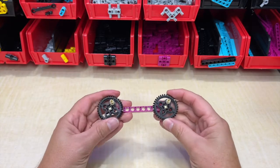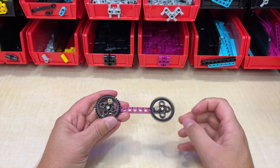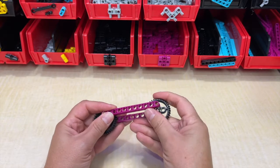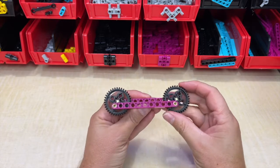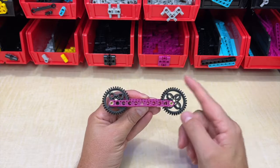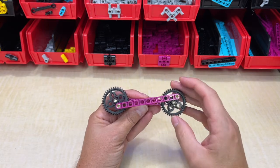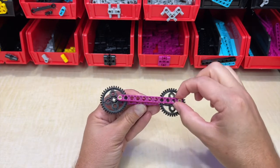I started with an initial model using two gears as a representation of the front and back wheels, the idea being the rotation of one drives the rotation of the other. Initially adding the coupling rod connects the two together and appears to be a simple solution, but in practice the following wheel ends up going back and forth instead of spinning all the way around. You can see the coupling rod doesn't stay horizontal but rotates at an angle. If the rod stays horizontal, it does indeed drive both wheels fully around.